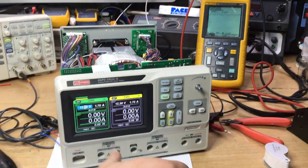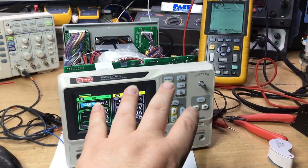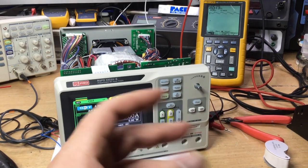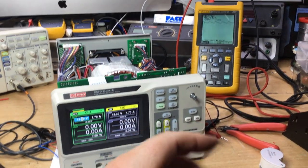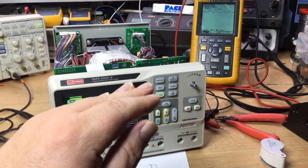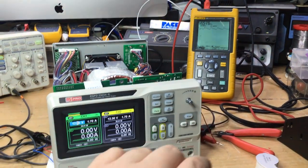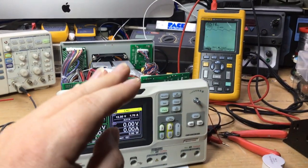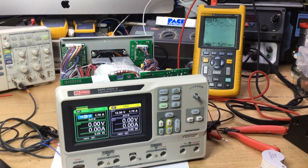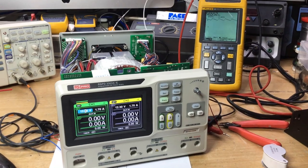So it's like thermal shutdown really, but the thing is that if it was a resistive short on the output of the bridge rec, which we went through earlier when discussing the fuse might blow, the bridge rec could get really hot when it's at 2 point something volts. Then what would happen is when you switch the supply off and you're measuring the voltage across the electrolytic capacitors, if it was that kind of resistive short, then the charge would immediately go. As soon as you withdrew the supply, the voltage would drop to zero.